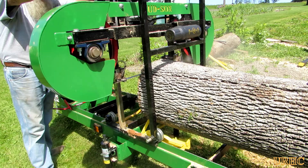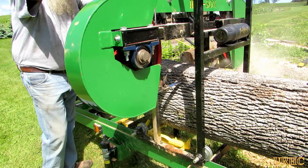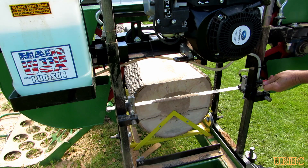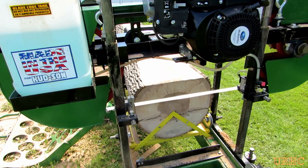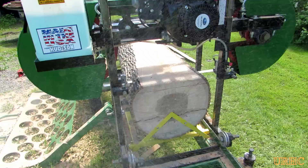As I got it on there, I just started whittling away at it. Right now I'm trying to cut it down to one and a half inch thick planks and get as many as I can out of it to get as many stakes as I can. I'm just slabbing it at the one and a half inch thick dimension. Then later I'll go back and cut them in the other dimension. When I was doing those small cherry boards the mill was rock solid, but dealing with this large dry ash log, there is a little bit of rocking - I'm starting to get up to the limits of this little mill.